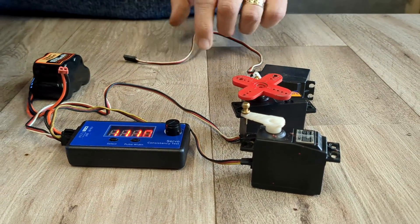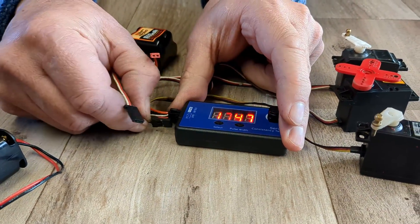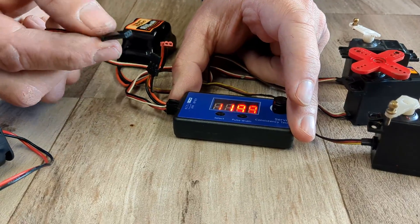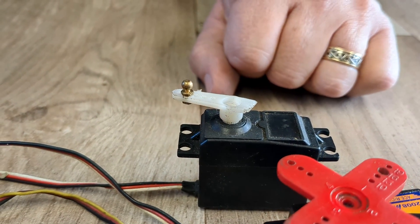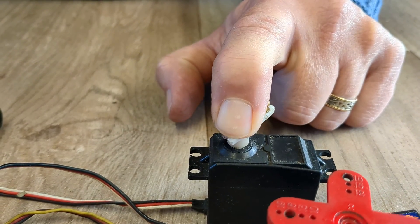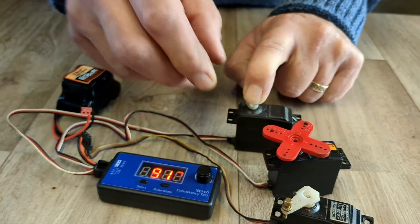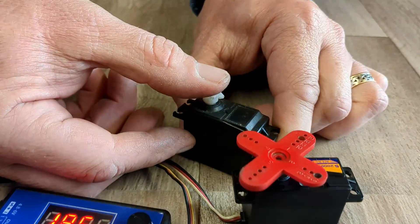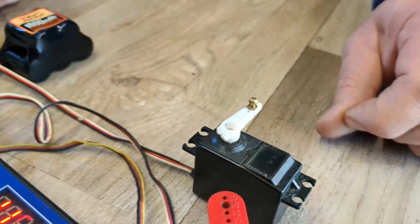So I'm going to plug in this one, which by elimination must be the faulty one. I'll unplug one of the others for now and plug in this one to see what happens. And you can see there immediately that servo is already failing — can you see it stuttering? If I were to put my finger on top of that it would probably stop. It doesn't like it at all. It's working, but it's not working very well. So that to me is a faulty servo.